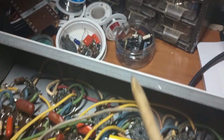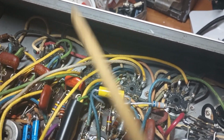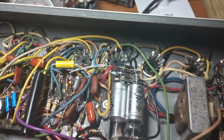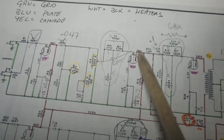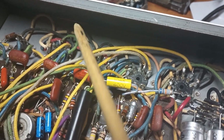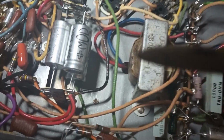All right, check this out. Tapping on this white wire here. That's going to tube number 4, pin 8, which is a grid wire for the normal channel second gain stage. So what I think we're going to do now, I was going to save it to the end, but we'll get some shielded wire for that. And also, let me shut this down before I go insane.